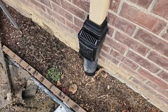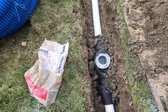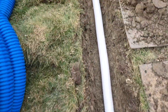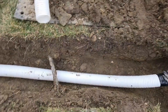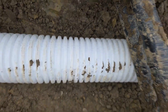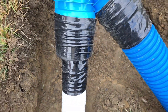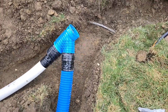We have two by three downspouts on this house. The guys got the three-inch plus hooked up — look at how nice this three-inch plus was to run. We got the catch basin, it already has the stone pocketed with some fabric around it. Take a look at how this goes right under the sprinkler lines — there's a double main right there. They had the perfect slope on the bottom of the trench and they were able to maintain it. They use a three-to-four increaser — it's an increaser-reducer depending on how you use it.